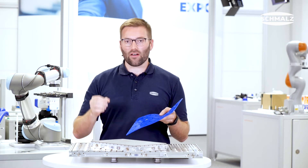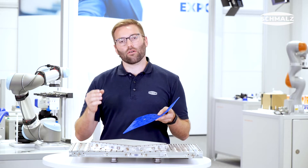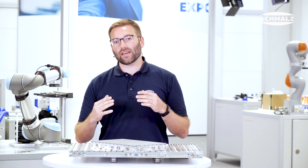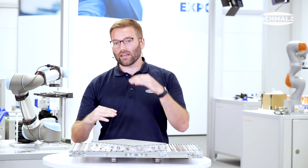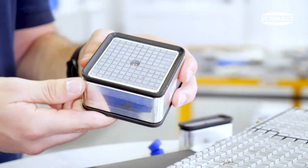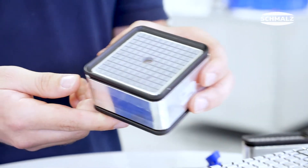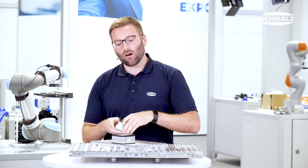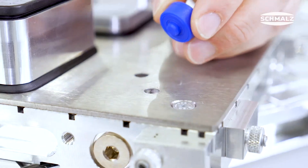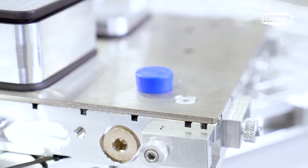That allows you to do cutouts, through holes, as well as machining the side of the workpiece. And once you want to do 5-axis machining, you need a little bit of space between the clamping device and the workpiece. For those purposes we have the InnoSpan vacuum blocks in different dimensions. You can simply place them onto the MatrixBlade and seal unneeded vacuum holes with those sealing magnets, enabling 5-axis machining.